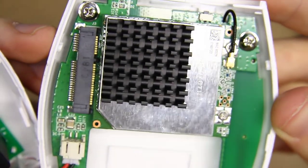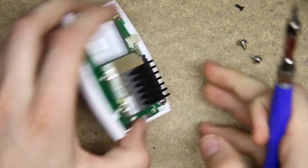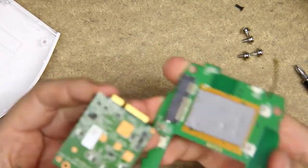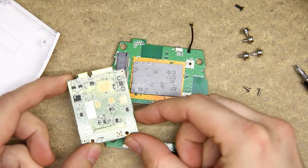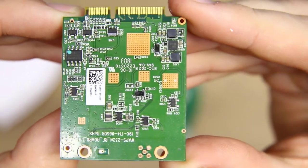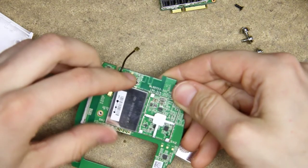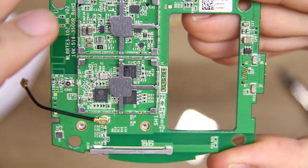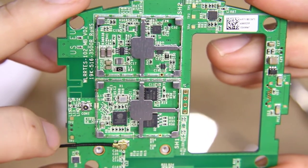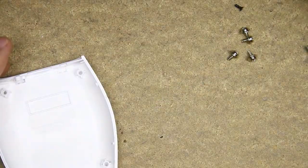The main PCB has a wireless module with quite a big heatsink — it could be an application processor or LoRa radio backend. It uses a mini PCIe connector, but I'm not sure it's possible to connect this module directly to a computer. The mini PCIe module has thermal conductive compound to dissipate heat. Removing the metal covers — which are not soldered — reveals that this device uses just the ESP8266, not ESP32 as I had heard. Next to the MCU you can see Winbond flash, and the third chip is the TCA9534A, which is an I2C input-output expander, most probably for buttons, LEDs, and some other slow GPIOs.